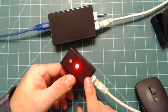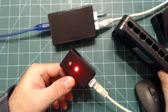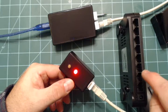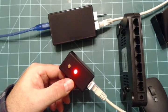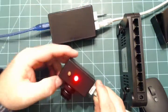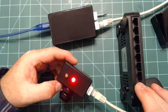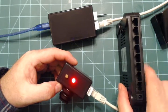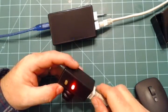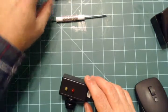Here it is - and I'll unplug it. This is the control box, all finished, works quite nicely. I'm going straight from the control box to this camera right here. If I had my other cameras together, I'd run from the control box to this hub, then put camera one, two, and three in here. For a fourth camera I wouldn't need another box - I'd just run camera four straight from the control box. For cameras five and six I'd need another box, running from the first box to the second, then into cameras four, five, and six.